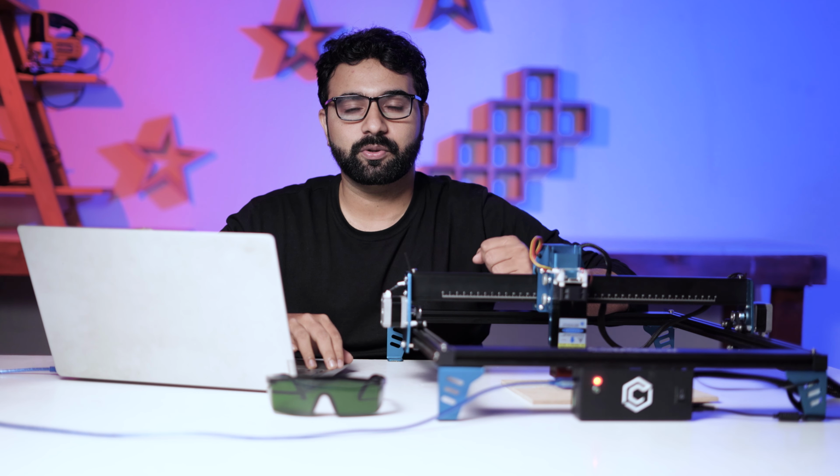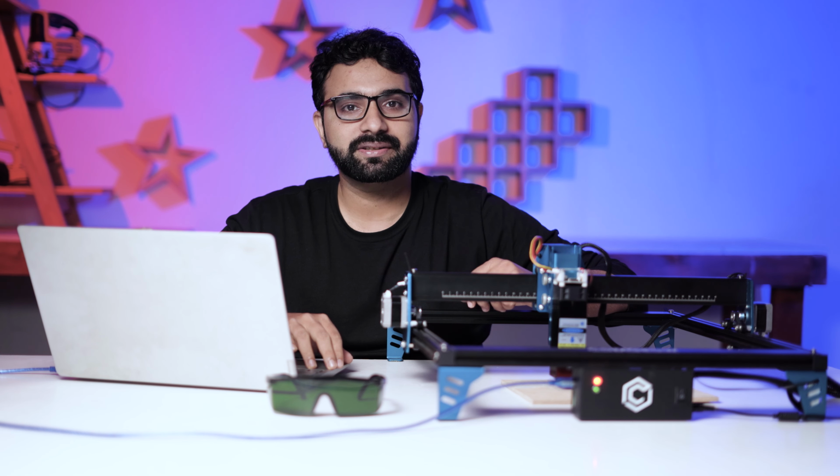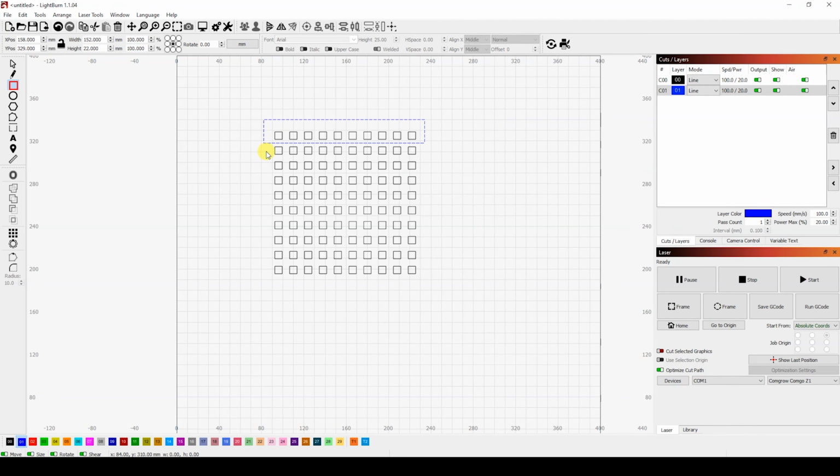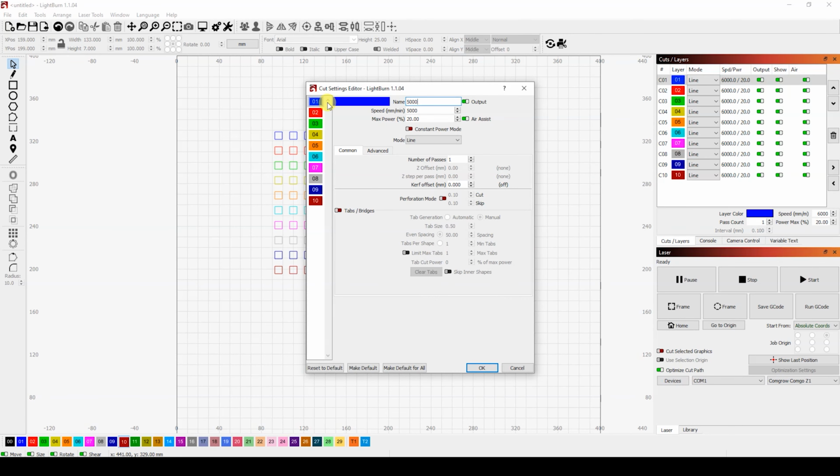One of the first things you want to do on your new laser cutter is to figure out the right settings. I have made a generic test pattern that I will run on some of the materials I have here. I have also made a detailed test pattern to check line spacing, engraving ability and cut settings which I will try on plywood. I have used LightBurn for creating these patterns. I will leave a link to the test pattern files in the description below.